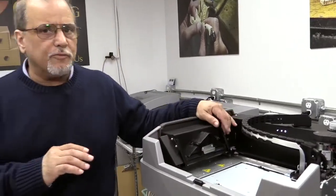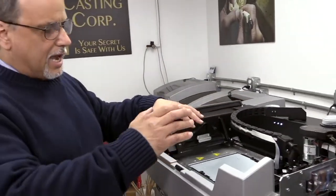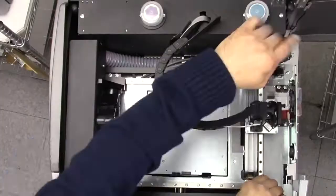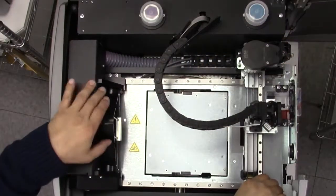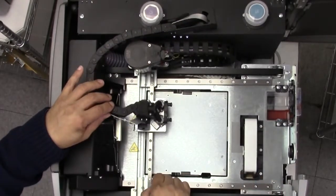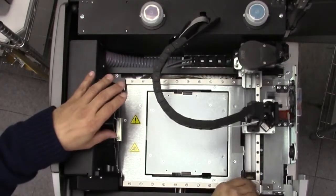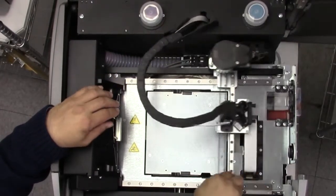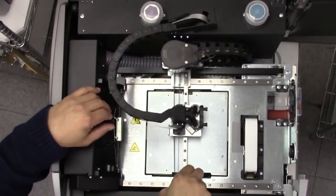For instance, if you're working and the machine is on and you see that it's going to a certain spot and then it goes back and purges and fires continuously, always when it goes to the same spot — that's not a jet problem.